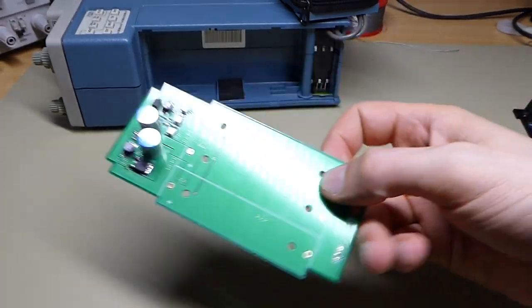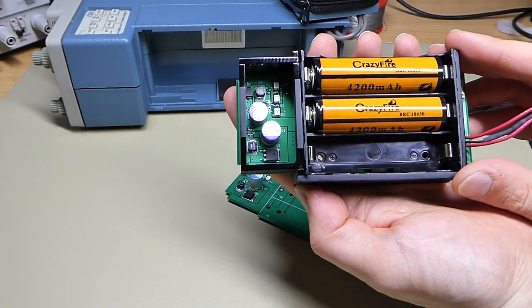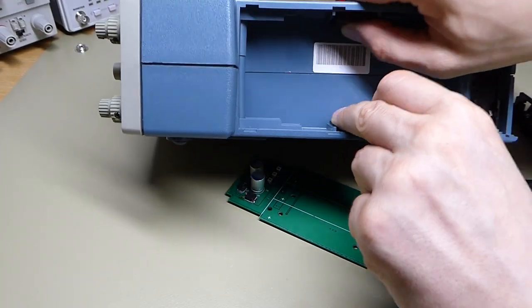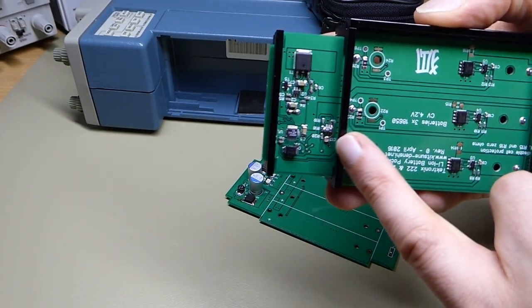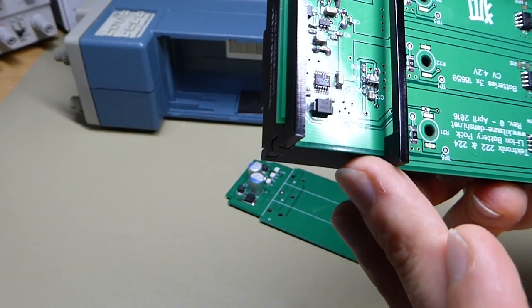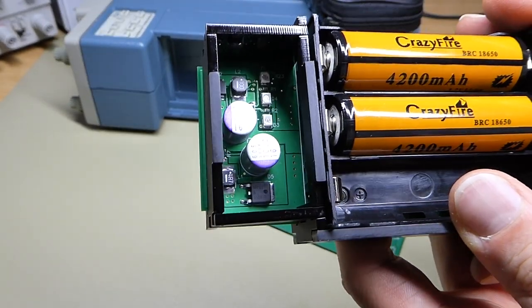Just to give you an idea of how the whole thing is built — it's basically a base board like this; this is one I used for playing around with. The case is built using cut pieces of 3mm acrylic, giving you basically that case shape, with one piece of acrylic running across to make the whole thing a bit wider so it actually fits in the scope and is held down firmly with rubber inserts. On one side I've got the boost converter and the battery charger chip, and down here I also have the comparator that looks at the voltage and switches between charging and supplying voltage. There are a few botches on this first-run board — in this case it was just a few issues with the comparator not going into supply and charge modes reliably.